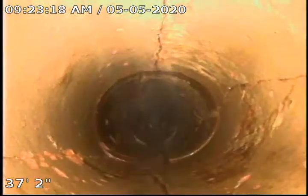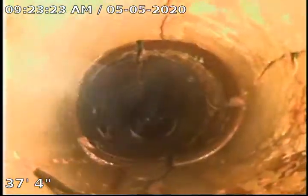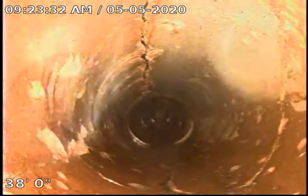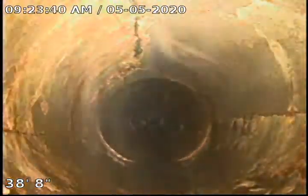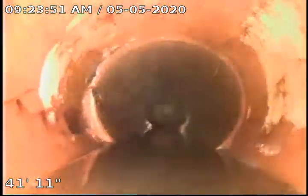You can see the cracking across the bottom of the piping and cracks in several areas. We were able to get this area here pretty clean — we did use a minimal amount of water and pressure. But you can see we have cracks that run across the top and the bottom, and also circumferential cracking through these tiles. This area is out by the sidewalk area. As you can see, we hold just a little bit of water here, but nothing that's too serious.